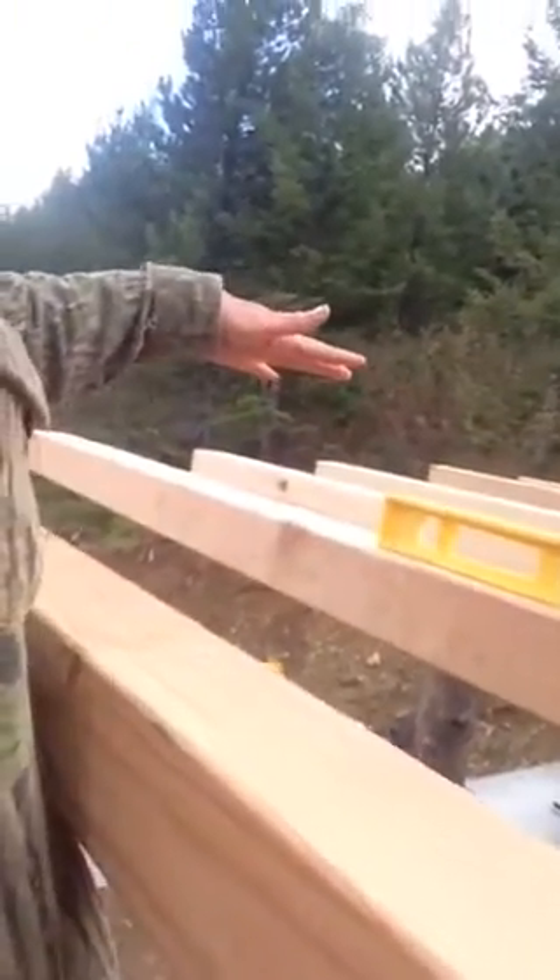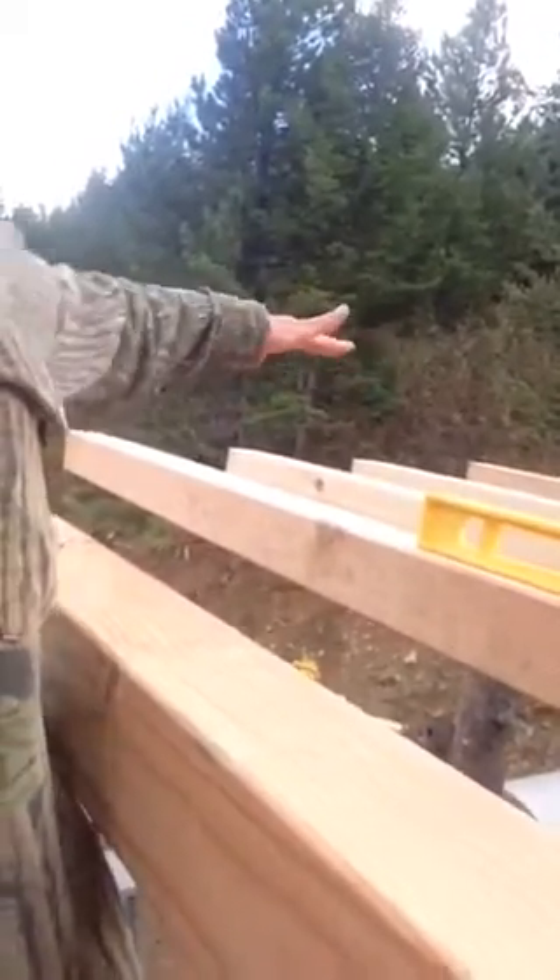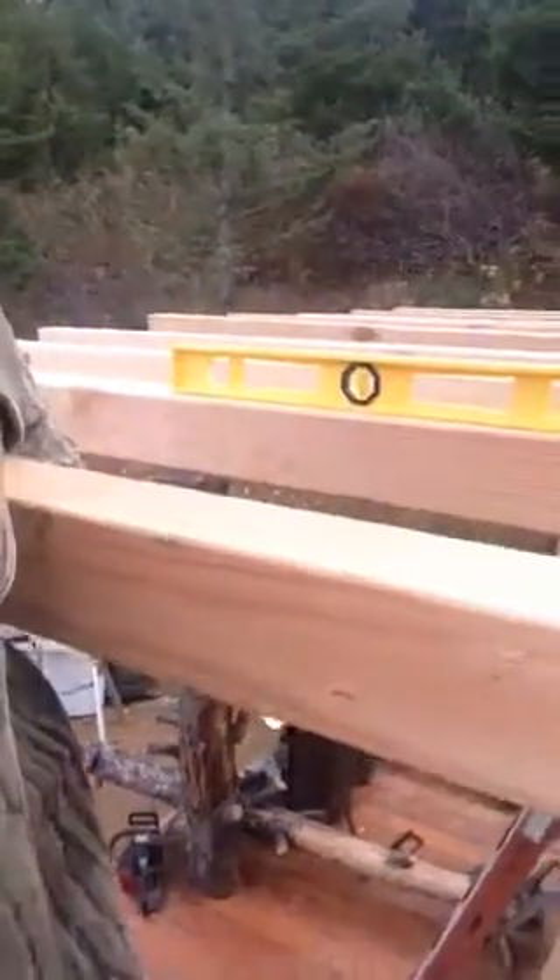It's going to have a beam at the end of the deck, and these deck posts down here will help support the weight as well. I'm also going to take and lag a 10-inch lag bolt down through here and into my upper beam. So I thought I would just show you that.